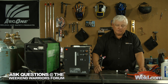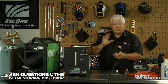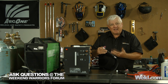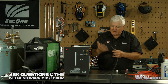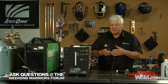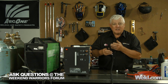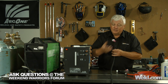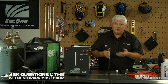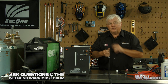I like to explain it like this. You've seen me use this torch. This is my favorite air-cooled torch for general industry, and this is a 17F, 17 flex head. It's a 150 amp range-capable torch. When do you decide that you can't use this anymore? Basically when it gets too hot. If it gets too hot and you have to set it down and let it cool off, and it's constant, that means you're running too many parts.